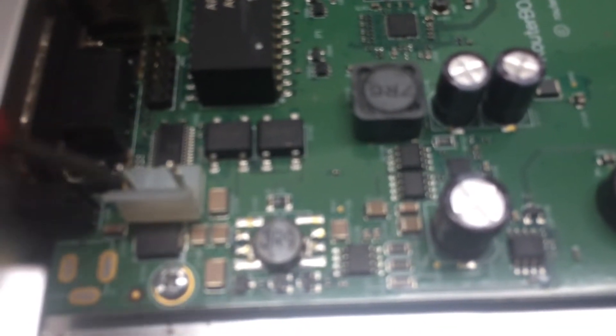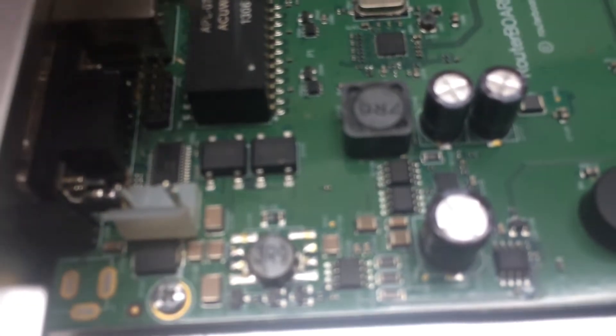These are the two AC inputs here, and this is the DC output — this one is negative, the next is positive, negative, positive. That just ensures that no matter how you connect this thing with POE power, you're going to get the proper polarity coming into the power supply. This is the positive pin from the AC power supply, and this is the negative pin. This positive pin goes through this diode right here. Once it makes DC on the inside, the output of this diode and the positive output from both bridge rectifiers are all paralleled.